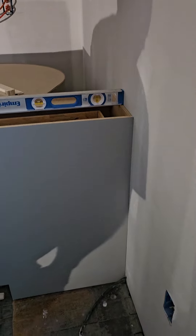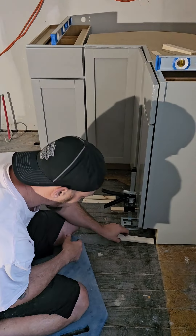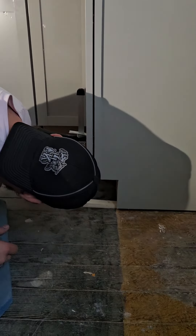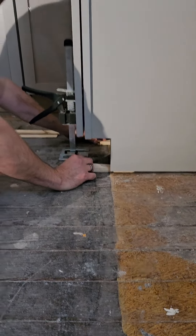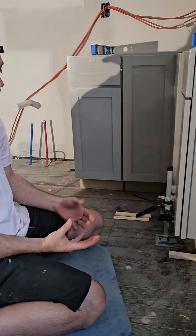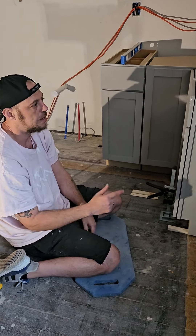Right there, just like that. You can see we're tight, flush with the wall now. Our shim work is going to be out here. It just makes it so you can slide these right under. We'll take a little jam saw, turn the blade sideways, cut these right off. Go to set the toe kick later on the floor and all that — be right on the dime.